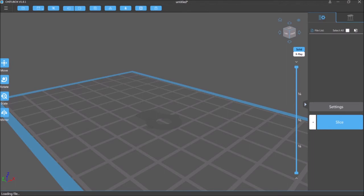I can do what's called a Z height of 0, and it'll at least give me a firm adherence to the print bed for those. And then I'll just have little supports under here and then other supports. Actually, I might not even create a support there. It took me a while to understand why I needed to have a lift in Z height. I thought it would make it look weird, but it's still fine.